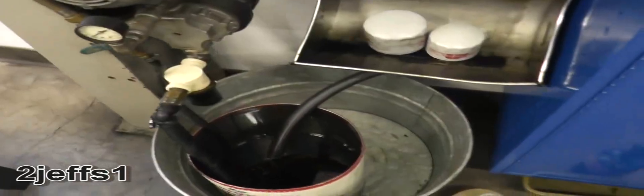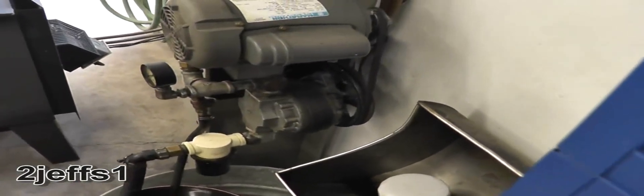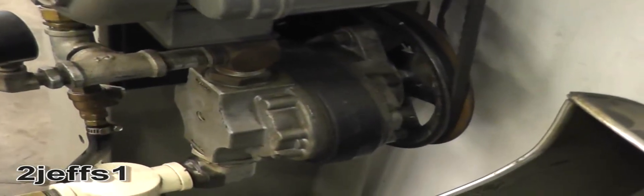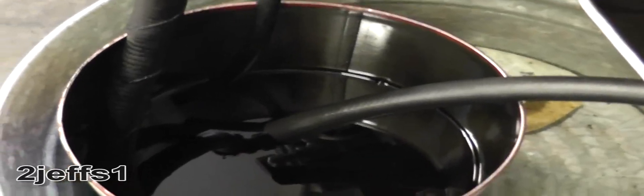This is how I get rid of the waste oil — I just dump it in here after you do an oil change. You come up here, turn on the switch, and that pumps it upstairs into the tank. The pump down here is a front-loader pump off a Case C tractor. I also have a filter in line, and down in there I have a window screen on that line, so you really don't get anything getting pumped upstairs. Normally the oil I get is pretty clean.